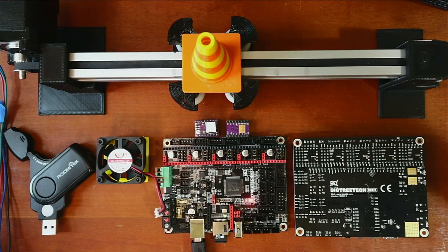Today we're going to talk about how to install a DRV8825 on the BigTreeTech SKR version 2. I need to point out a couple of things. First, I'm going to remove the actual USB power for a moment. When you're running direct power, you're going to have to move your jumper over to the other two sets of pins.